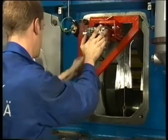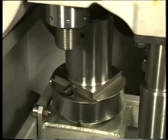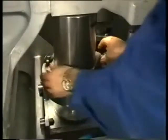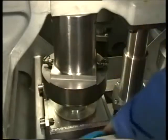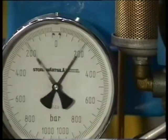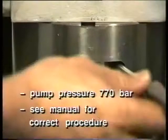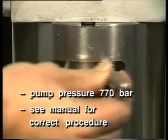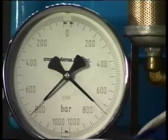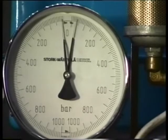Pressurise the jack to 200 bar and tighten the nut. Now the main bearing cap studs can be tightened. Provide the jacks as explained earlier for the disassembly procedure. During assembly, the jack need not be turned back — it can be connected directly to the pump. Now the jacks can be pressurised as required. Count the number of holes when turning the nuts. The number of turns must be approximately the same for all nuts. Now depressurise, retighten the jacks again and try to turn the nut further.